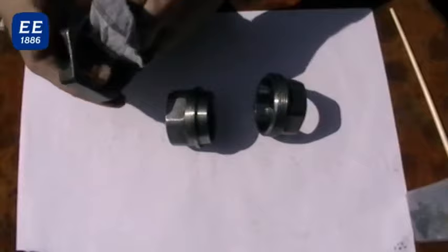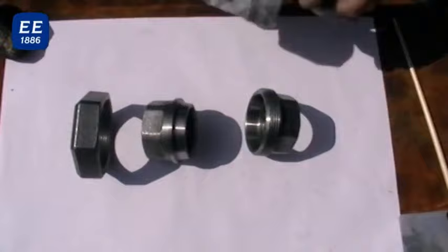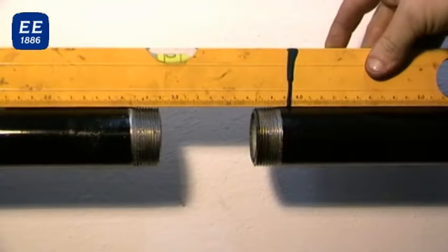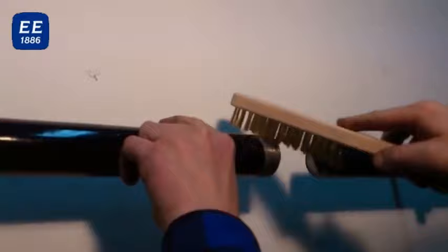The taper surfaces and the head surfaces of the nut shall be cleaned by clear rags. Tubes that will be commonly connected have got external taper threads. There shall also be checked the coaxiality before the correct assembling. Afterwards, the threads of the pipes shall be cleaned.